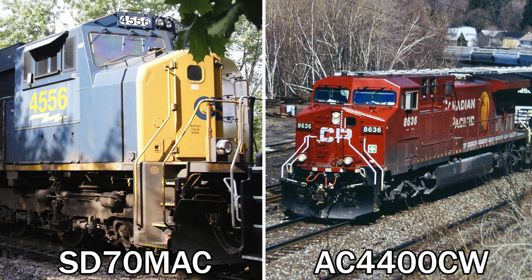Furthermore, cutting out one axle on a GE locomotive isn't necessarily considered a safety defect by the FRA, so the locomotive doesn't have to be immediately routed to a shop for repairs, giving GE yet another advantage. With the EMD setup, a failed motor will result in the loss of almost half the horsepower produced by the locomotive, impacting the train's running time, once again giving the advantage to GE.